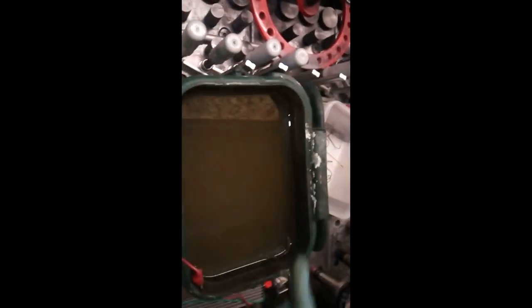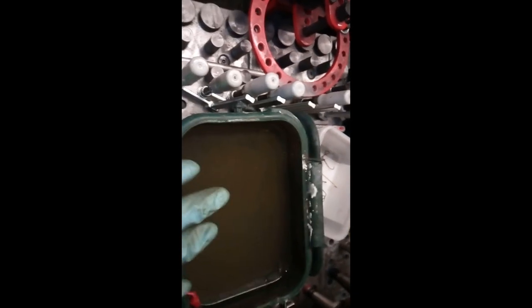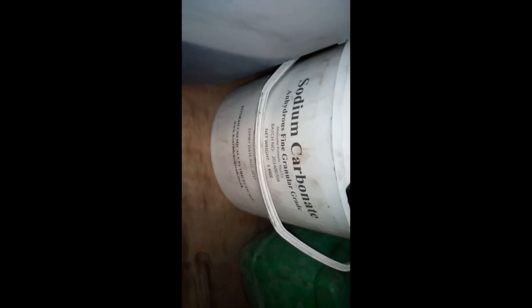It's a tight fit because it's stainless steel brazing wire. You can see it coming out and it's wrapped around a little part. It basically curls around the side making a Faraday cage with the positive supply. The water is distilled water and I'll just show you the tub — it has sodium carbonate in it.